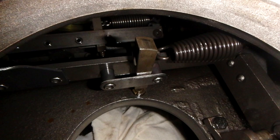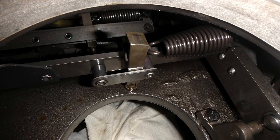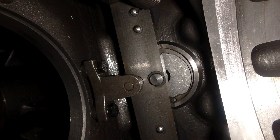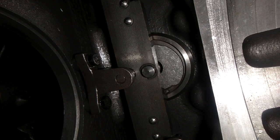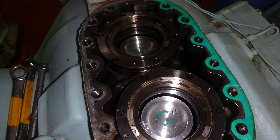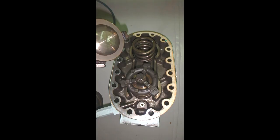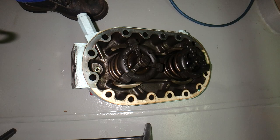Again, here we have an examination of all the parts. Also the body, as you can see here, is all cleaned with compressed air. All the parts here will be examined, and one of the damages was caused by one nut which was modified by the previous crew that was on board. Somebody made the overhaul, I really don't know who, but we don't care about that. The main problem was that it was modified and not replaced with the original spec parts that were on board. I don't know, maybe they wanted to save the spares for something else, but as you can see here, it's better to put in the original spares so you will not have any damage.